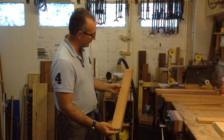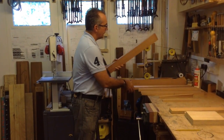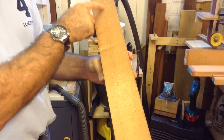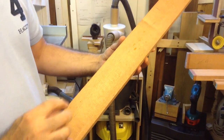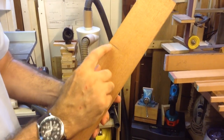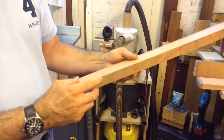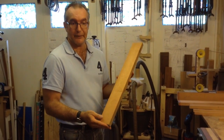For example, this plank looks really good with very nicely quartered grain — you can even see the medullary rays — but it has a couple of ripples. More importantly, there's a shake marked in pencil here where the grain is broken across, which probably happened when the tree fell under stress. There's nothing we can do about that, so it won't be used as a neck. But it would be a really good piece to use for peones.